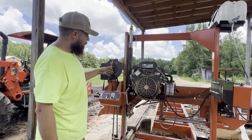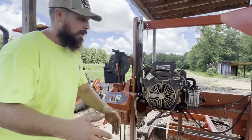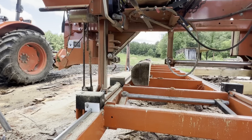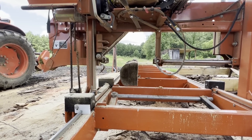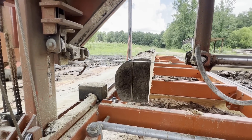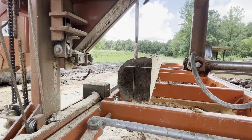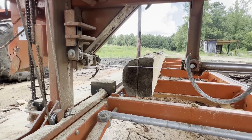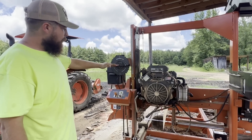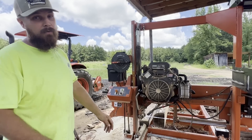So now let's start by finding our first number. We want to go down here - nine inches is divisible by three, inch-and-a-half is our goal on the bottom. But if I look at that, it's not really going to make a board right there. That nine inches ain't really going to get enough off the top to matter. So my next available number to start at is seven-and-a-half, because nine inches minus one-and-a-half equals seven-and-a-half inches. So let's take that slab off at seven-and-a-half, and then we're going to go six, four-and-a-half, three, one-and-a-half - and that's done. I'll show you the pile of two-by-fours we're left with.